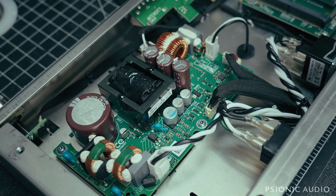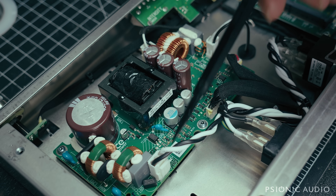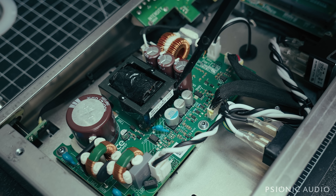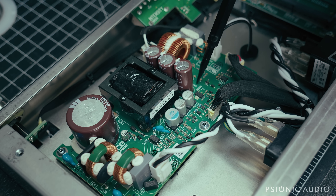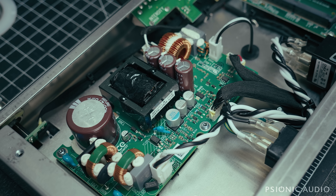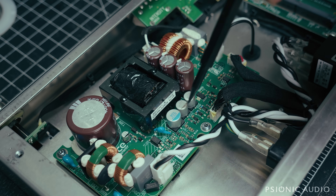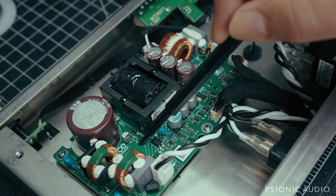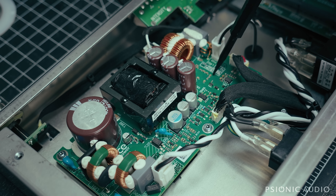The rumor was a diode was burning in the power supply. Well, this is the power supply — this is the actual ICE module — and it's not uncommon for these things to have problems. Sometimes diodes, very commonly the problem with an ICE power module, is a ferrite bead burns and opens or goes short. I looked around, found which ICE module this is, and could get another one for about $135, so $150 with shipping. That was the break-glass-in-case-of-emergency option.